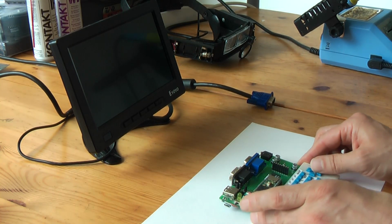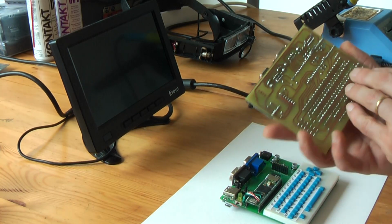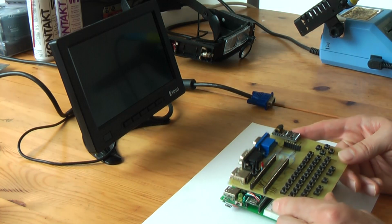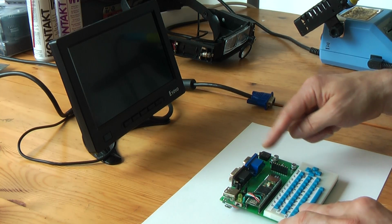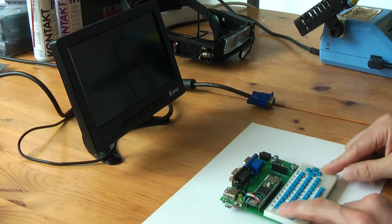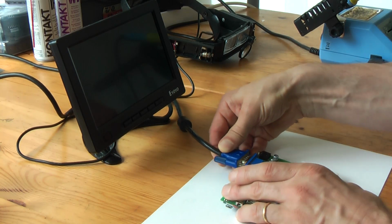This version is actually the second version. The first version was a prototype that I did some time ago, around Christmas. The PCB was etched by myself. Slightly different, but the functionality was already there. This version is using the PT8211 for the audio, like the Teensy crew is often using. It's a quite cheap DAC for Teensy. The Teensy 4.1 has the SD card, and you can just connect it to a VGA screen.